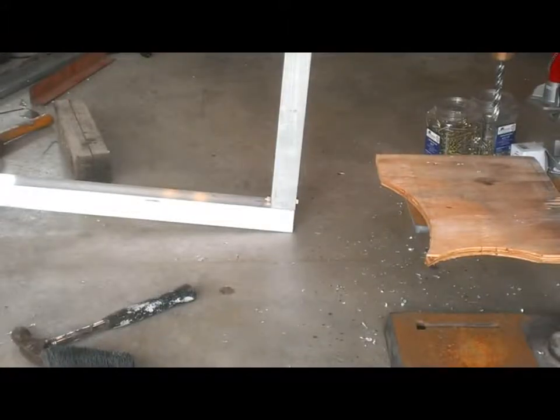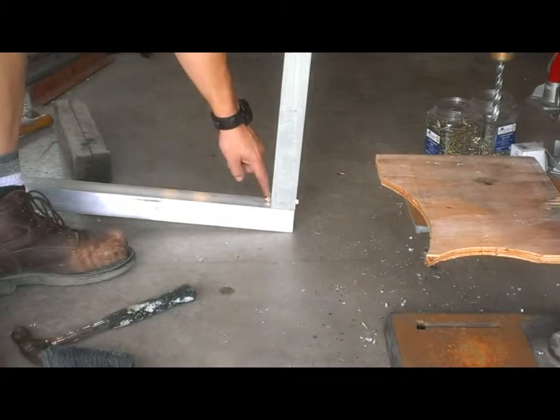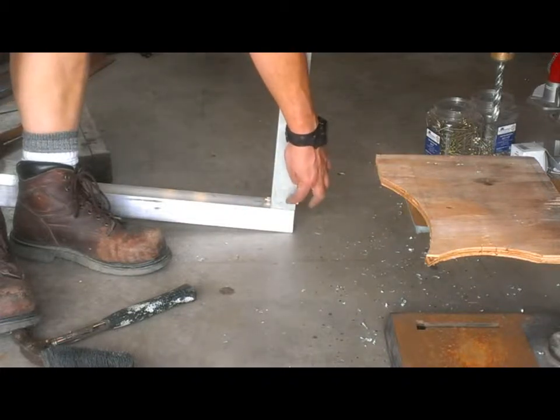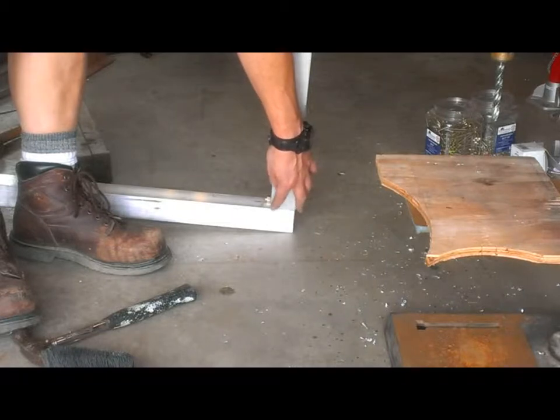As you can see, or maybe you can't see, the nut over here is actually right up against the metal. There's a very thin portion of aluminum on this tube that hasn't been cut through by the drill bit. You can actually score marks on this side with the drill bit. So the 1-inch steel piece that's in here is providing good support. The 3/4-inch aluminum piece beside it, inside the tube here, is probably a little thin on the bottom.